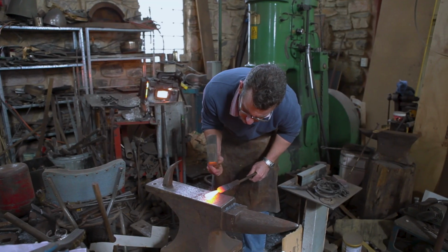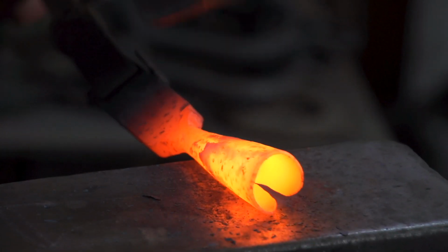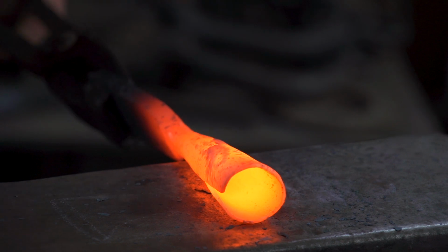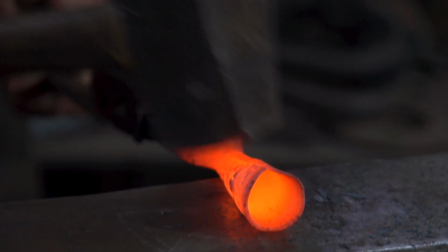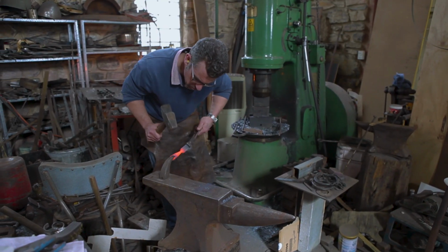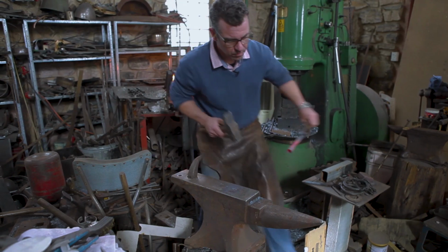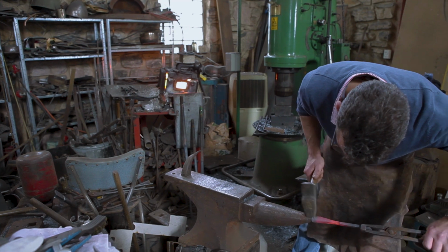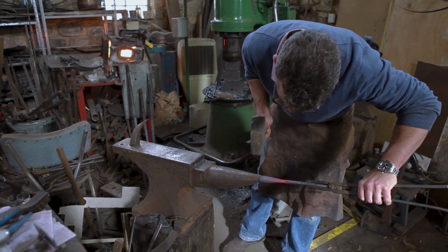Okay, so flare out the socket with the fuller, roll it into a socket shape basically, and then fire weld the edges together. And that could be the same for a whale harpoon or a wood chisel or a Viking spear. Nothing really much has changed for a long time, with different shapes in material.